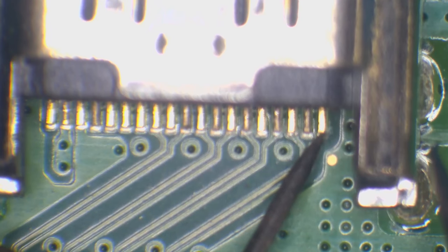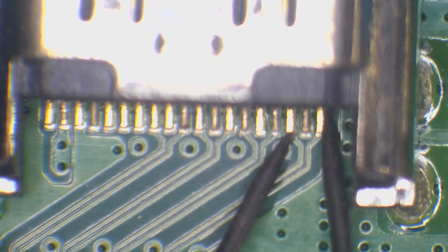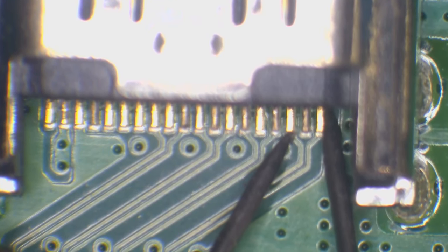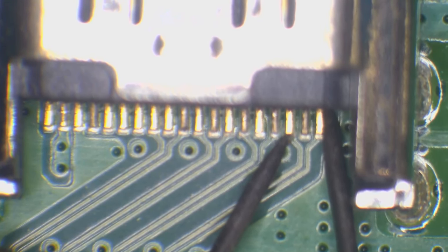So you've basically got a filter there, ground, and then a filter. And ground is separating the pins. You shouldn't have a low reading there. But that's not telling me that the filter's bad. That's telling me that the encoder's bad, because the filter's not blown, and there's no reason for it to blow, because it hasn't been messed with.